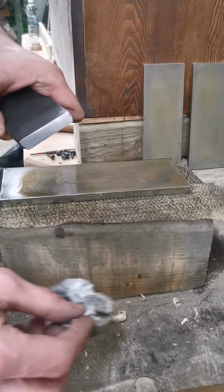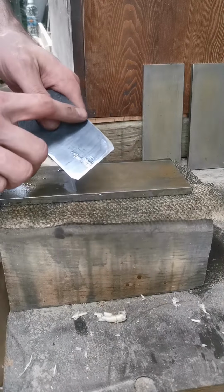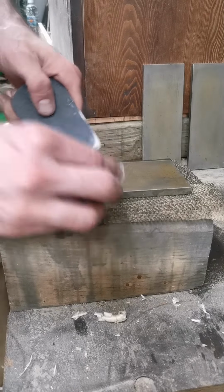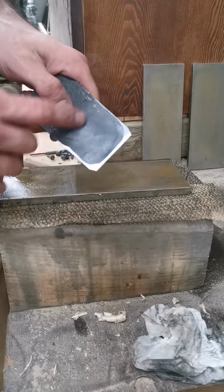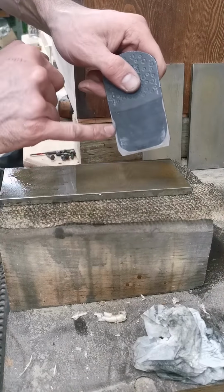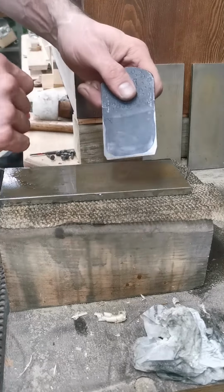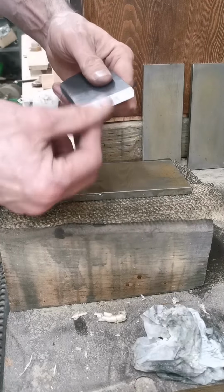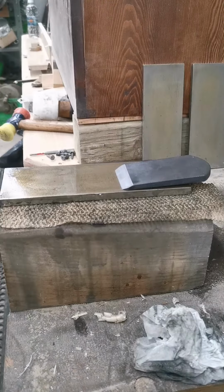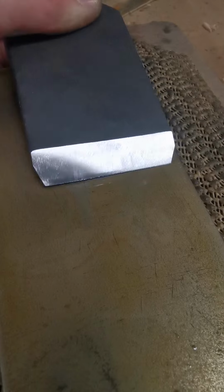This is sort of the same thing. There. Now I'm happy with it. Now we've got a bearing surface, even as thin as that is, it's all we need. I like how they dish this. That's clever, because then I'm only flattening the bearing surface, which is way less work. That's an extra coarse. That's my scratch pattern. I'm quite happy with that.